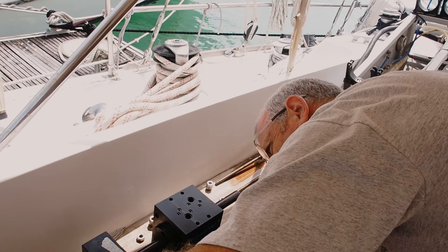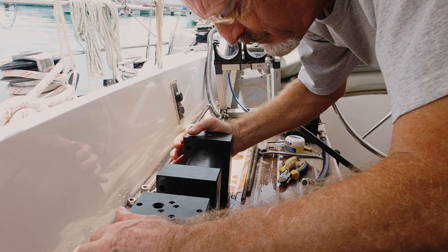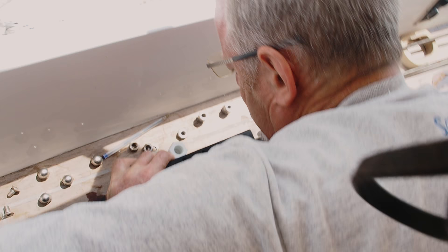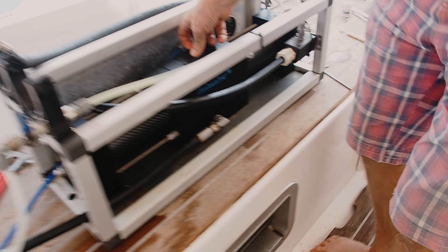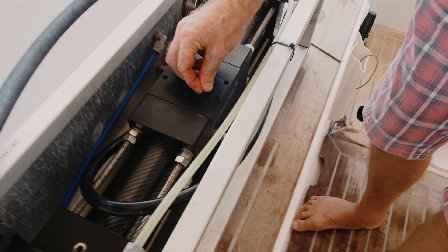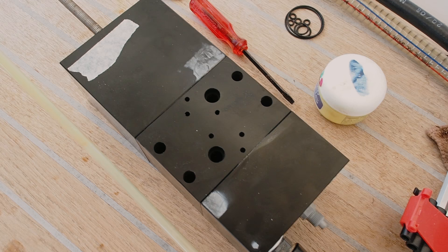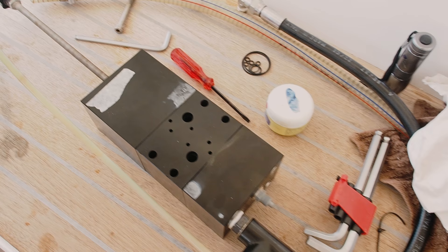The new pistons are in. The lower unit is now in place, held underneath with four allen bolts. We've reconnected the hose, and Phil is putting in the o-rings that sit on top of the lower middle block. These line up with the upper block, and fortunately with this design there is only one way it can go in. With the watermaker sorted, it was time to put everything back together.